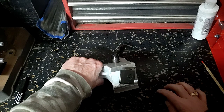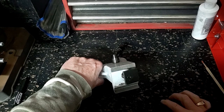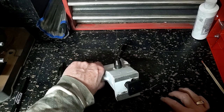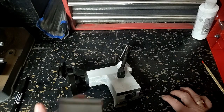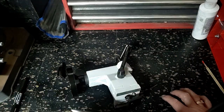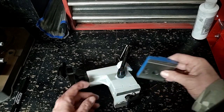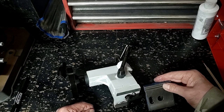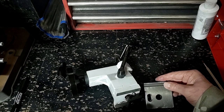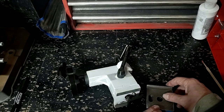We'll see how well it works when we get it on the lathe. I'm hoping this should solve virtually all my tail stock problems, at least for now. I will probably recut the Vevor tail stock plate at some time in the future and put the Vevor back. But as you can see, the notch on the Vevor is just too shallow and there's no recess. The reason you want to recess it is so it doesn't drag.